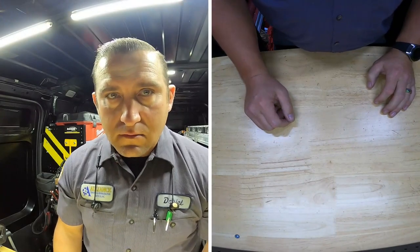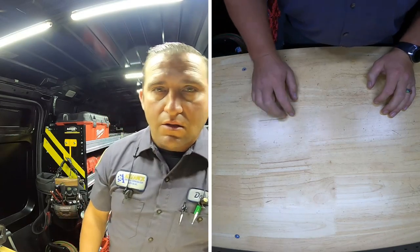Hey guys, thanks for tuning into Alliance Tech. Today we are actually working in a freezer. Last maintenance I was out here, I noticed a fan motor had bad bearings, and it kept tripping the VFD. So I've already isolated the breaker and set the power to the coil. We're gonna get the scissor lift ready and get inside. Right now we're gonna prep the motor first, get it all prepped up. I also have a sub-cooler controller to replace as well, so stay tuned.